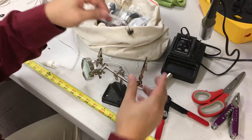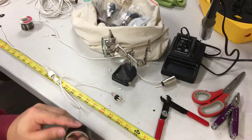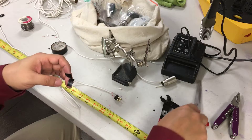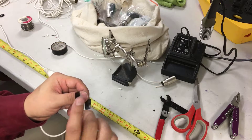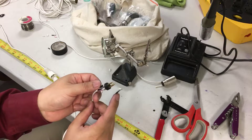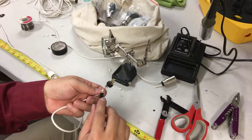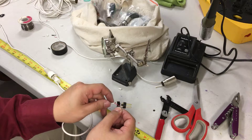That's it for soldering. Let it cool down a little bit. What I'm going to do is put a little bit of electrical tape just for safety — even though it's not necessarily required, why not just do it for peace of mind? Just to make sure nothing touches. Still a little warm so be careful — after you solder it stays warm for a little bit depending on how hot you have your iron. Putting some electrical tape around the areas, just making sure things don't touch.